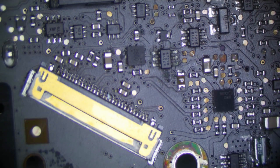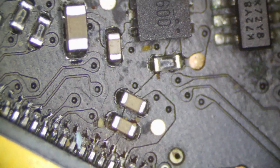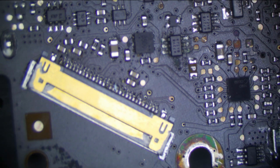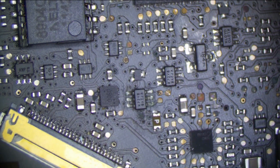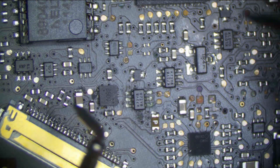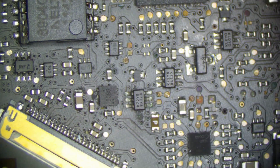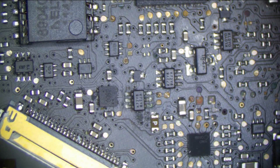For anyone wondering, I checked backlight output voltage and resistance to ground at these two caps right here — these are our backlight output capacitors right before the signal goes into the screen. We do see we have a little bit of corrosion here. My main question is whether the fuse is going to be blown. On this model, the backlight fuse doesn't typically blow — it's usually the connector that melts. But let's check this fuse. And what do you know — the fuse is actually blown, so the fuse actually did its job.